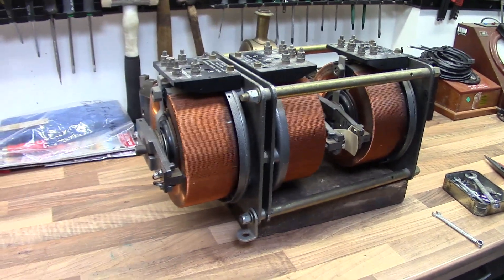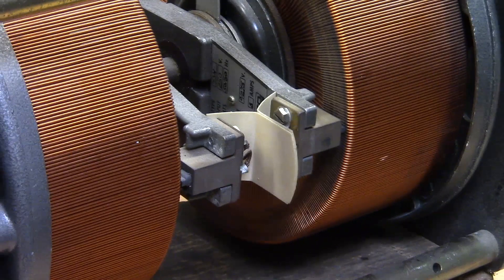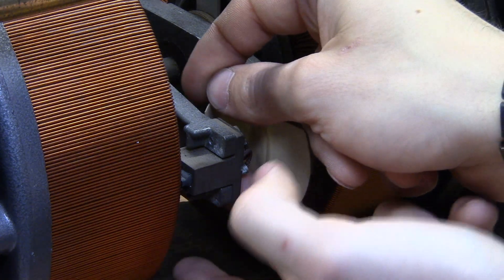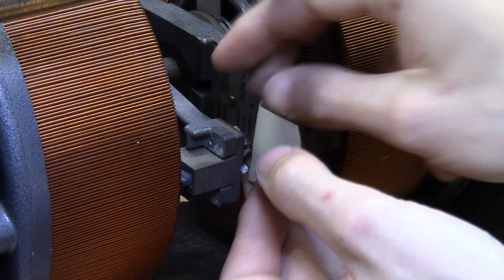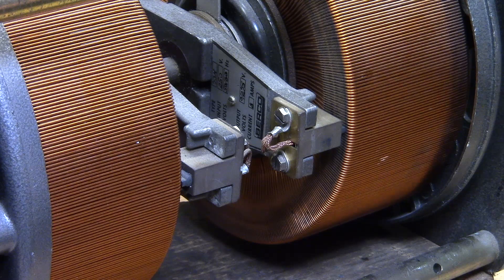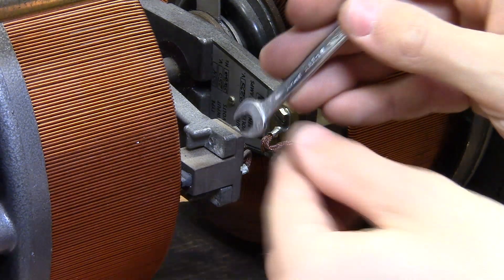I've already done the front one here — he's already done. We've got 2 more over there, so I'll just take out those little dividers, because there's 400 volts between that, maybe more when it's wound up, maybe like 500. They're not like paper, they're dipped paper. Just take those both out, and it's not easy to get in there with a screwdriver, so I'll use the little quarter-inch drive spanner to take this off here.